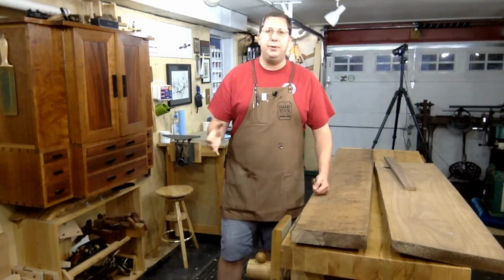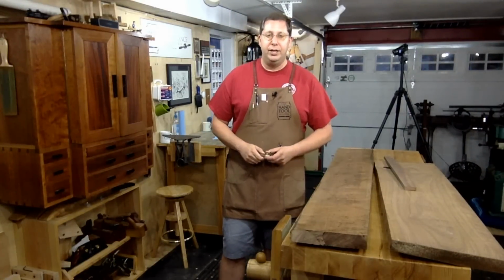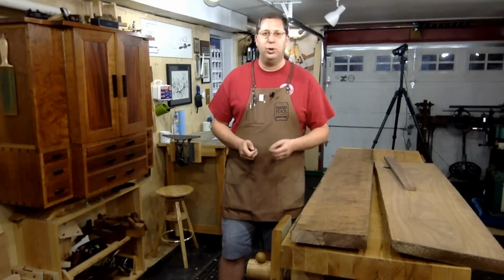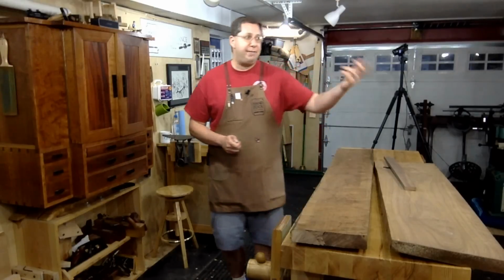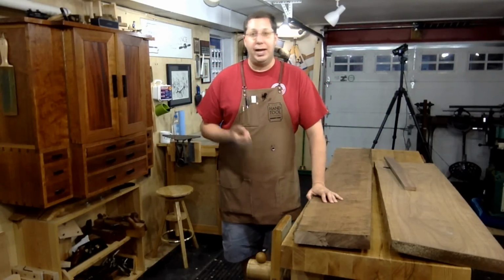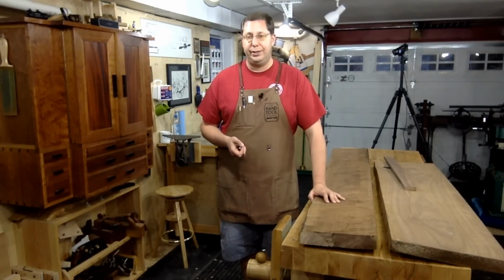I want to cut green wood that is 16 and 32 quarter thick. You can tune the Rake and Fleam on that saw to have a nice positive rake so that it cuts real well through green wood. And you can set it in such a way that it does a great job for that. I have a saw that I specifically use for 12 quarter and thicker wood. A lot of that was pitch, but it was also very, very aggressive rake to cut very quickly through that.